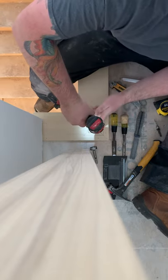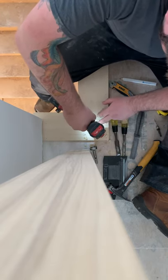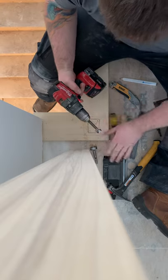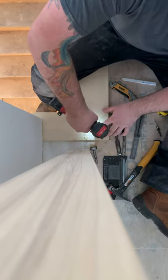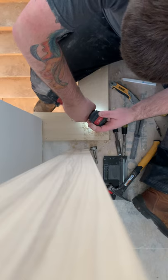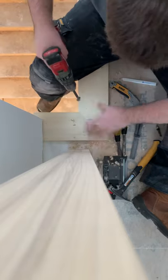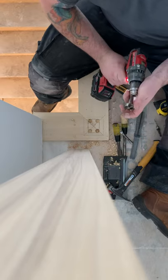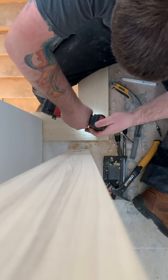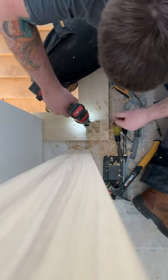go ahead and get your mortise bits. And this is probably a half inch thick here. And I go until it's flushed out because that plate is about half inch also. So once that's done, I just roll it with the big one. Get as much wood out of there, so you have to do less chiseling later. Get that about level with the ones you already did.